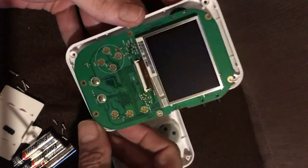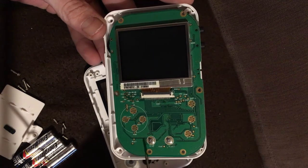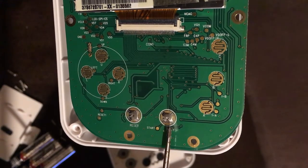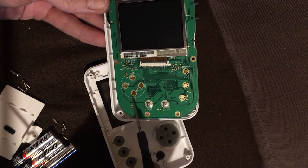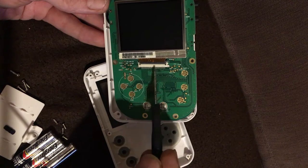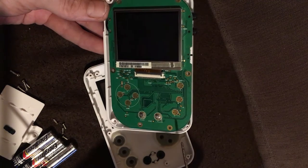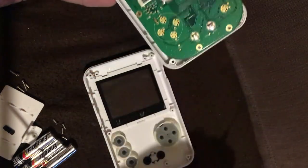The board just lifts right out. On this side all we have is our controller markings. Interestingly, the buttons for Select and Start are actually soldered-in pressure pads, which I've never seen before — not on a clone console anyway. It's strange why they've used that for them and not everything else. We've got our LCD screen here with a standard connection — they haven't soldered it, it is socketed, which is quite decent. You'd be able to find compatible screens, maybe bigger ones; there's quite a lot you can do to this, and it's all pretty much marked out with the markings.